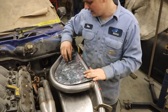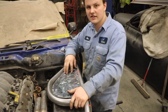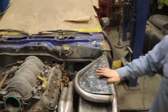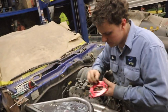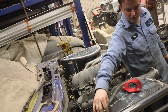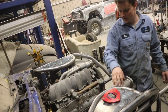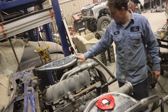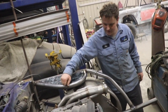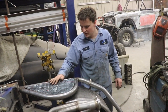There's a lot of space back here. I think I want to do some dimple dies back here but we don't have those yet, so I'm going to just tack it in and come back and fully weld it once we do that. There's about this much space without the top hat - you can kind of see there's all this room and I think it would look really nice with some dimple dies on this plate to give it a little more flare. Once we do that we can fully weld it in and our strut tower should be done. We're also going to do a down support off of this one down to the frame rail - we'll show you guys that once we're at that point.